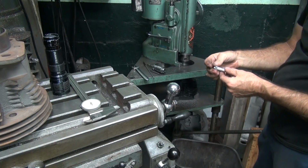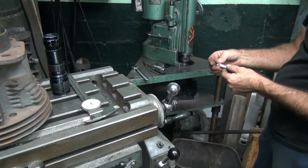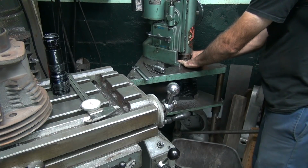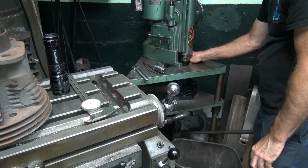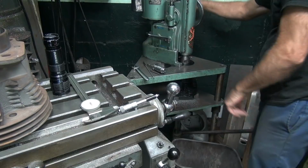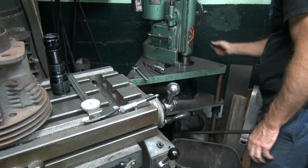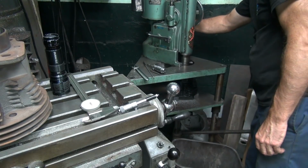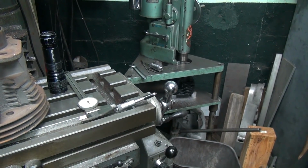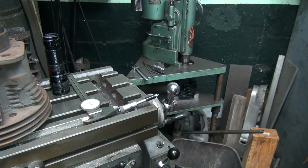Okay, we just go in a little bit. Set our, we go check it to see where we're at. Let's see, 43 would be half under, would be right there. Yep, got just a little drag on it, just like you want. All looks good to me. Slow speed. We got slow and a half, but we're cutting 20 thou, so we'll get the lower speed. Takes longer to get through, but I'm gonna overlay the cover.